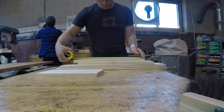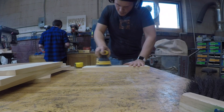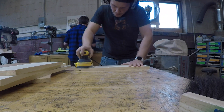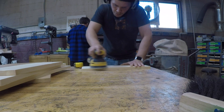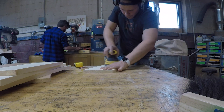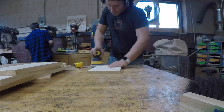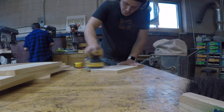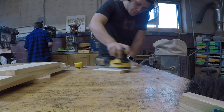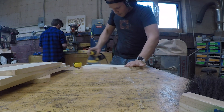After a little measuring to find the length that would be best for my design, I sanded the surface down really well so that I would have minimal sanding to do later. I wanted the board to have a really good surface starting out, because some of the lettering would be laser etched directly onto the board, and sanding too much weight later could erase these etched features. One of the features I decided to etch was the text used for secondary lettering — the text at the top and bottom of the sign — because the typeface used here was super thin and narrow and just wouldn't work cutting the letters out individually, as they would be super fragile. After the sanding, I was ready to head to the laser.